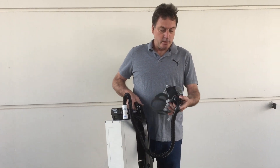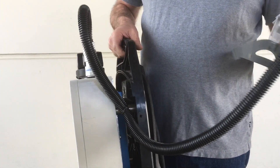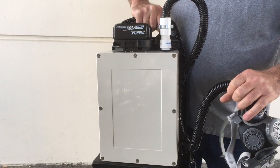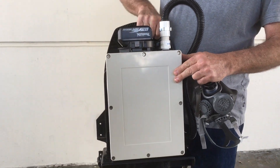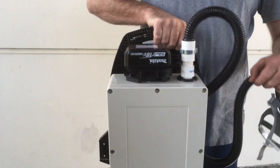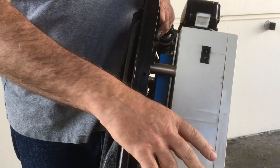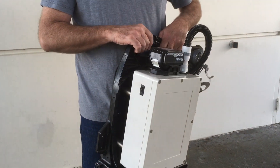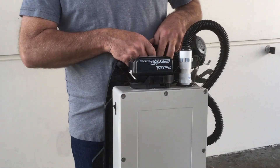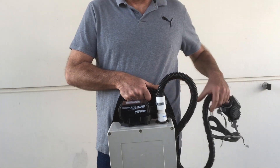What I did was basically order online a mask that has a respirator, and it came with a tube. I ordered a box and used an 18-volt computer fan inside, a Makita lithium-ion battery, a switch, and a HEPA filter on the back held down with an aluminum frame that I made — all mounted on a backpack blower frame. This high-quality Makita battery will last a long time; I calculate about 40 hours. It's a 5 amp-hour battery common for Makita tools in the last several years.